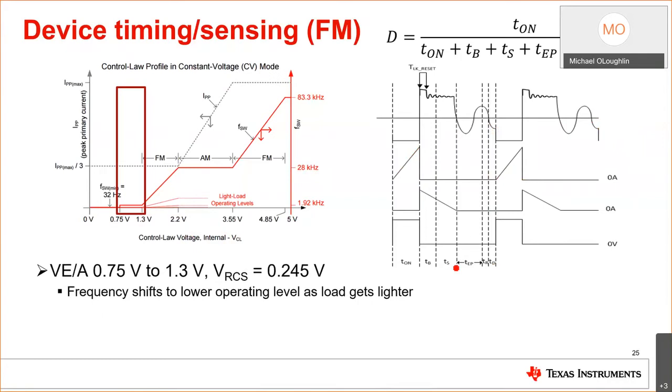And as the duty cycle needs to decrease even less, we remove all our output power. We have none, okay? So what do we do now? We back down to 32 hertz, okay? In other words, there's nothing left in the tank. That's the lowest we can go, all right? You do need a little preload. To make this no preload, you'd have to go down to 0 hertz, and essentially your output capacitor bank would get huge. So that's why we don't go down to 0 hertz.